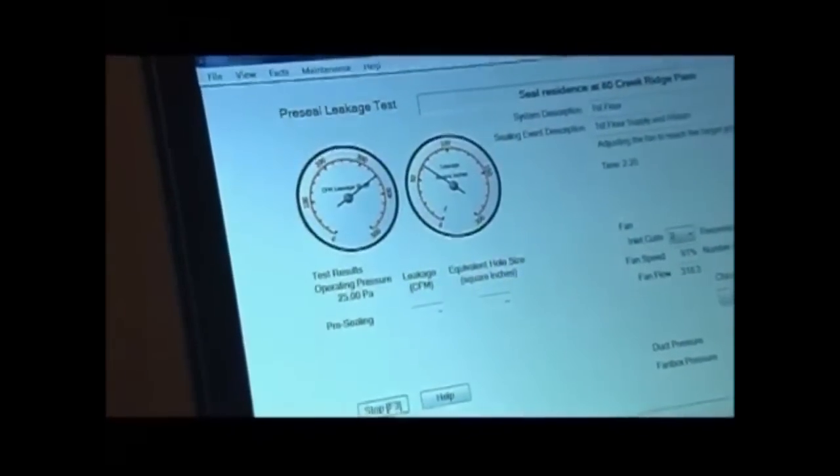We're going to find out how much the system leaks. The computer is going to pump air into the system. We ran a tube upstairs and it's going to measure the pressure up there as opposed to the pressure down here, and it's going to tell us exactly what we're leaking out of the system. Every single one of those leaks is energy lost. This is going to be the best way to not lose energy in your home — number one thing you can do on top of doing windows or insulation, because all that air is not making it where it's supposed to go.